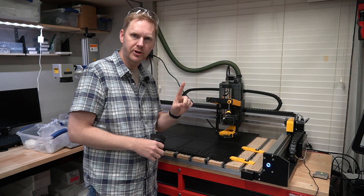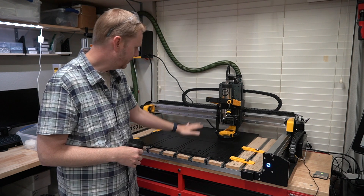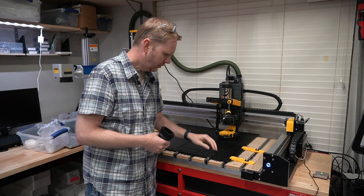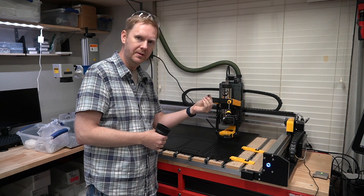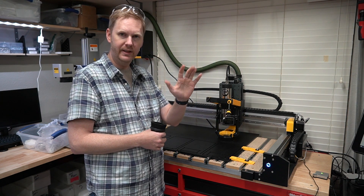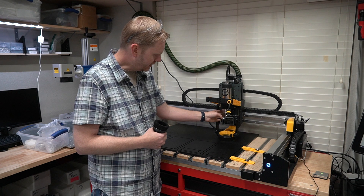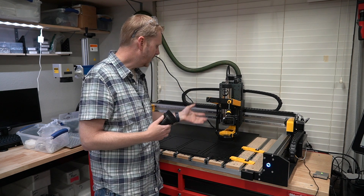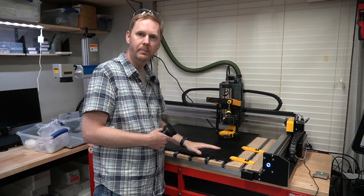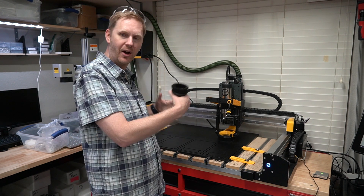The cut has finally finished the first round. We've got the two inside panels and the two outside panels, and I'm about to flip it over. Before I do, it's important to know that we're dealing with plastic, which comes off in pretty fine little granules. No dust boot can actually handle this mainly because it has some static cling to it — there's electricity built up, especially with the brushes moving across the surface and the high speed of the motor. It's good to have your vacuum hose handy so you can do some really immediate local cleanup, and then we'll flip this over and run this cut again.